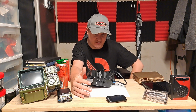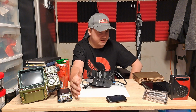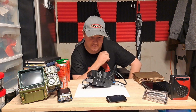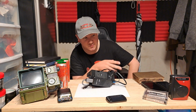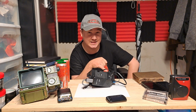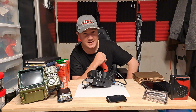Now, some people might tell you, go get a Raspberry Pi, or you can build an Arduino, or this or that. And the Arduino isn't going to work for that anyway, because that's the wrong thing. The Raspberry Pi, most of them are incapable of running Windows. And if you do want them to run Windows, certain ones can, but it requires a specific workaround where you have to install certain things to get it to basically emulate Windows. And given the fact that most of my audience probably doesn't know how to do that, we're going to stick with the Intel Compute Stick.